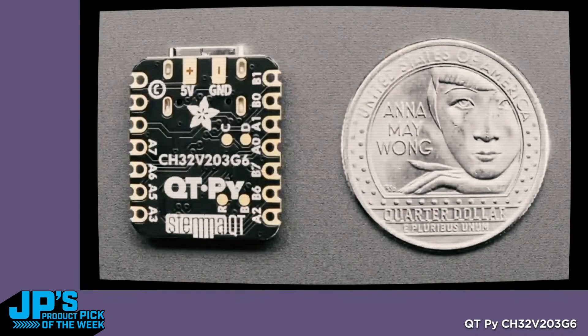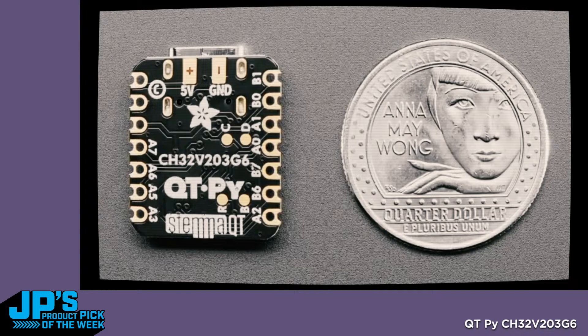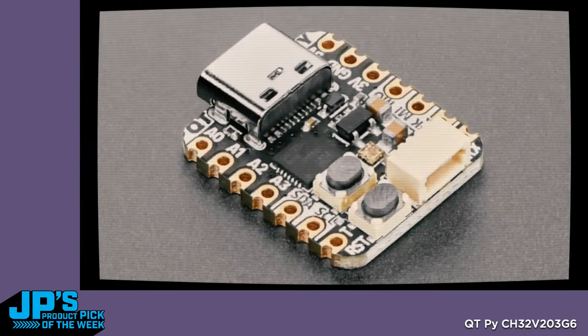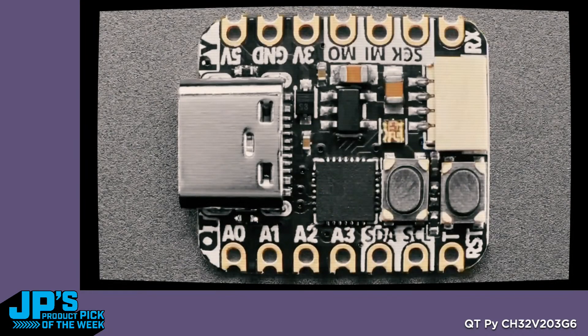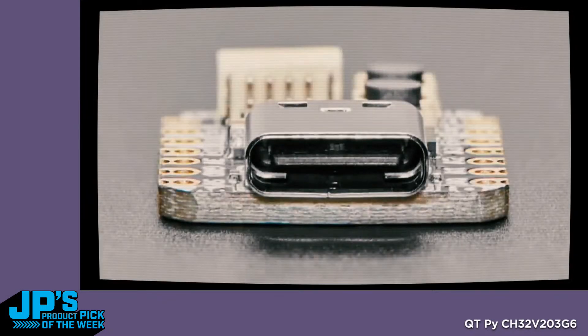It's still a hacky chip — not for beginners, because it doesn't have auto-reset built in and some peripherals are kind of funky and don't work. But it's a pretty nicely featured microcontroller board. I think there's a future of ultra low cost RISC-V chips hitting the market. People have been experimenting with this board using CNLohr's ch32v003fun repo, which is great if you want to use makefiles. It's never going to run CircuitPython — it doesn't have enough memory. But people might port Lua to it or something. Arduino works kind of-ish, okay.